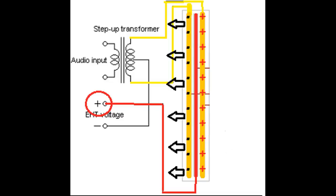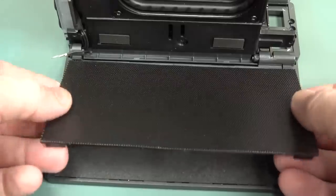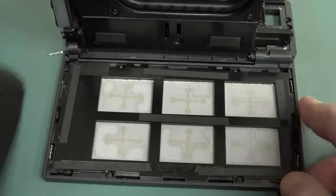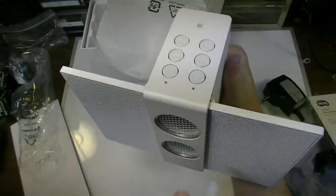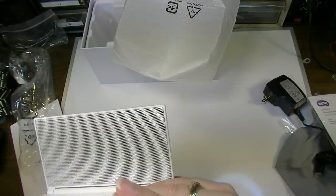The other thing about these is that the sound will actually go in both directions — you'll have sound coming out the back of the speaker and also the front. The thing about this particular model though is that it does not follow these exact specifications. There was a video on EEV Blog where he took one of these apart and actually the speakers themselves work on a slightly different principle, which was kind of oddball and I don't claim to fully understand it. Someone called them an electret type speaker. If you want to see these completely taken apart, there are one or two videos on YouTube already, so I'm not going to bother doing that in this video.